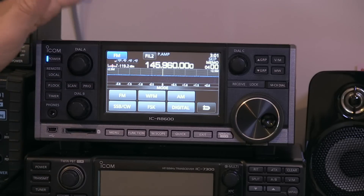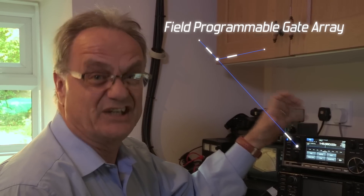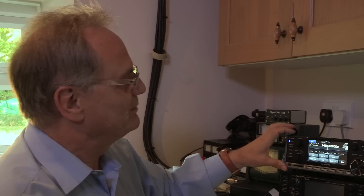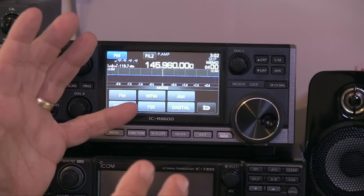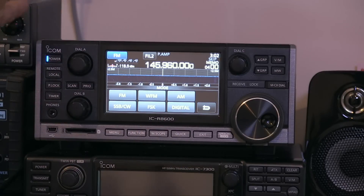Why is this such a special SDR receiver? It is based on FPGA technology — field programmable gate array — which means it's doing most of the demodulation, signal processing, and DSP. For HF the signals are sampled directly into the AD converter, but for VHF and UHF — from 30 megahertz up to about 1100 megahertz — it's down-converted to an HF IF which then goes to the AD converter, giving you superior aliasing and image reception reduction.